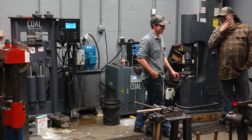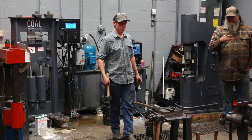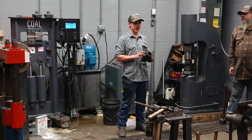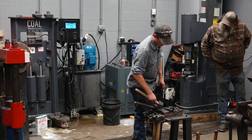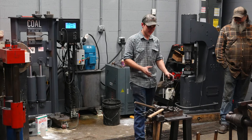So, just like the last two heats and the heats on the cheeks before that, even though we're using a larger fuller, we're going to do the same hits. You can see how this process works, especially in a group class. If you have eight people you're trying to teach, going together in pairs of two at four different stations, and you tell them these hits, this is something they can remember. No matter whether it's the first time you do the cheeks, the second time, or the third time, it's the same hits. You can remember it.